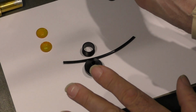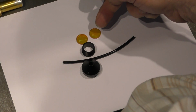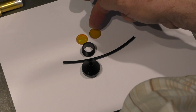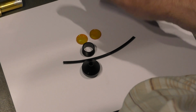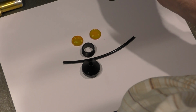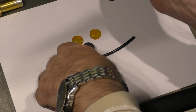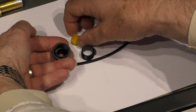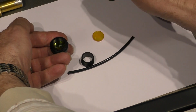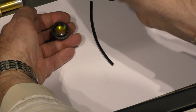If you order a compound nozzle, then what you'll get in addition to that, you'll get 2 lenses. Now one of these lenses is a fairly cheap Chinese PVD 1.5 inch 18mm diameter plano convex lens, and the other one is a rather expensive American CVD lens, which is 18mm diameter again and 2.5 inch focal length, 63.5mm. What we need to do is to assemble this in a certain order. So we'll take our nozzle, and we first of all, with the flat side downwards, or the concave side downwards, we'll drop the 2.5 inch meniscus lens into the bottom. And then on top of that, we'll drop the 1.5 inch plano convex lens.